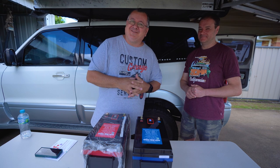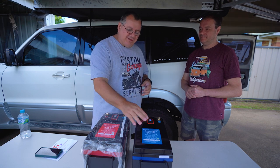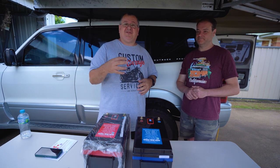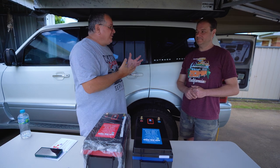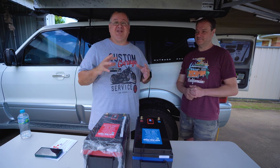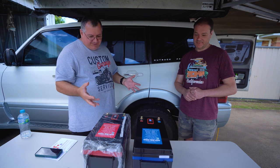The amount of power you get out is the same, but if you reduce the voltage you increase the amps. If we can keep the voltage higher, it's just more efficient for the whole system. We were pushing 370 amps out of this battery — it's not advisable, but short term yes. If you've got two in parallel you'll have no problems with those sorts of loads. Check out a YouTube channel called Extreme Auto Caravan and Camping in Adelaide — he uses Paul's batteries and runs off-grid air conditioners, hair dryers, microwave ovens, induction cooktops, and kettles all at the same time.